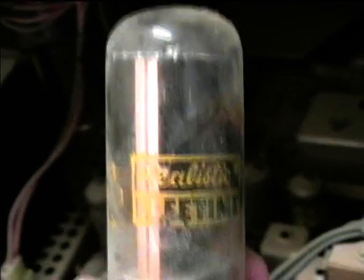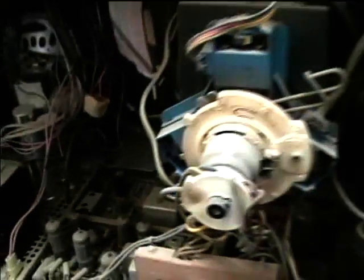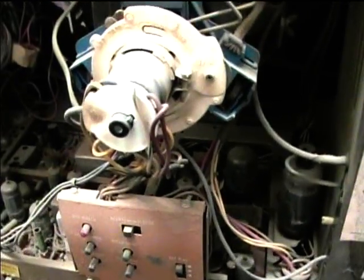This may be an owner that did his own TV maintenance. There's a tube here - this looks like a damper tube. Let's make sure that the set actually has a damper in the circuit. Well, it doesn't. We'll have to put the damper back in. That's probably why they said it didn't work. So let's put the damper in and see if we get some high voltage. The power cord is now attached, so I'm going to turn on the set. I have not turned this on at all; I have no idea of how it's going to work.